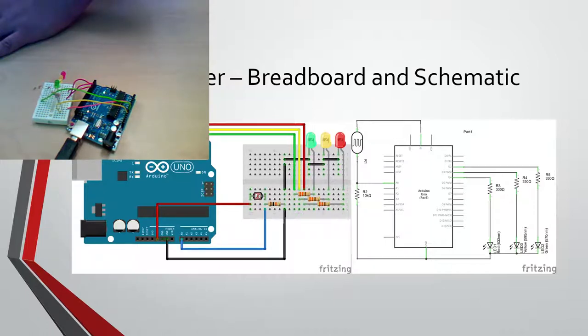So basically, this is the same setup we had with the resistors and LEDs last time, where we have our data pins at the top of the resistors. I would look over here, it's a little bit easier to see. You have your pins to the resistors to the longer end. This is the longer prong, or anode, of the diodes. And all the shorter ends are connected together to ground. Let me draw a picture.